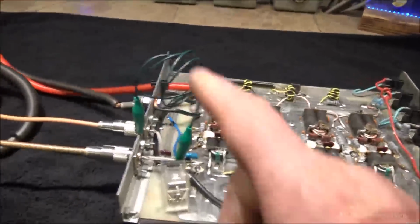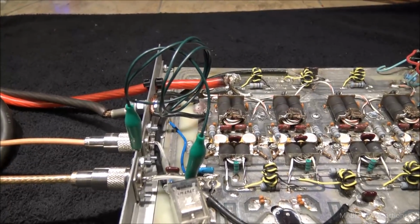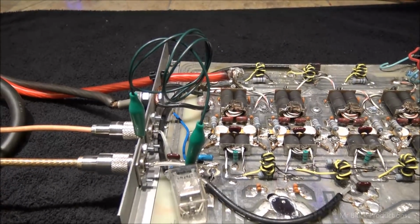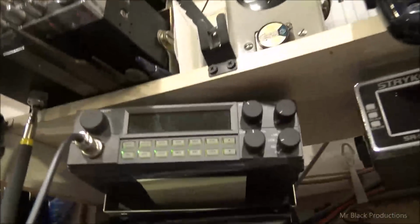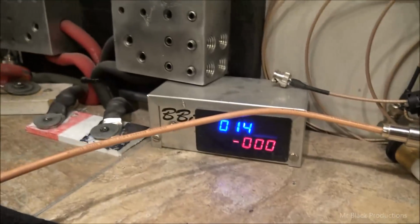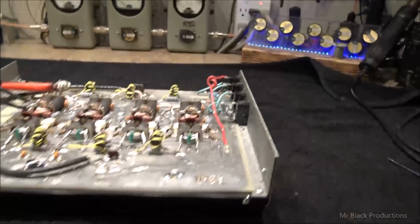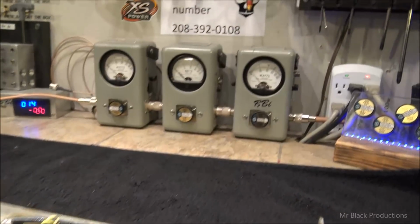Okay, so I had to permanently ground the relay because the keying circuit is not wanting to stay latched. So we're going to start out at really low drive power. We're going to take the 2950, a 5-watt slug between the 2950 and, of course, the 12-pack. We're going to hit this thing real quick. That is a 1,000-watt peak, 1,000-watt average slug, a 5-watt slug in reverse, a spectrum bird, and a 10,000-watt dummy load at around 14 volts. So we can't talk through. Well, yeah, we can. Hello.